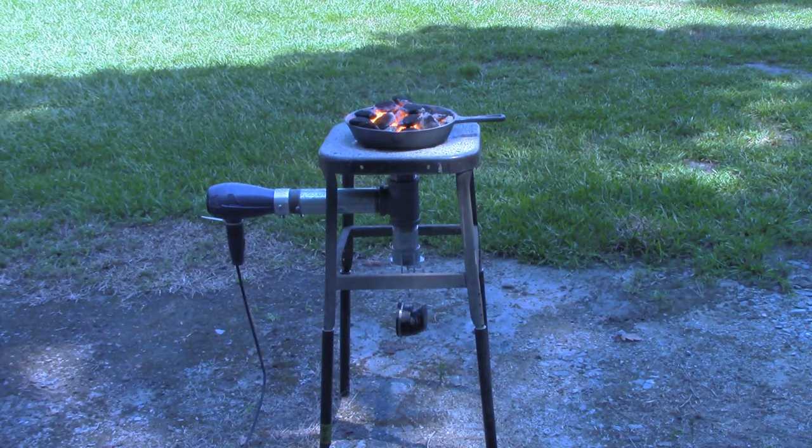This forge is going to be just like the milling machine in the shop in there, and the lathe and the surface grinder, and even the hand tools I got in there. It's going to take a while to learn how to use this, but it's definitely getting the piece hot. I've added a little bit more charcoal. I think coal will work a whole lot better. The charcoal is burning up pretty fast. Of course, it's cheap charcoal. It may be part of it.